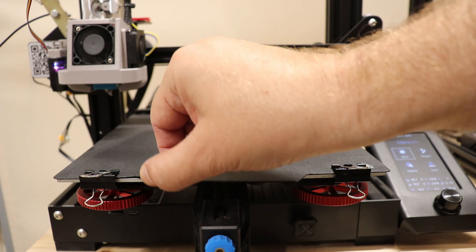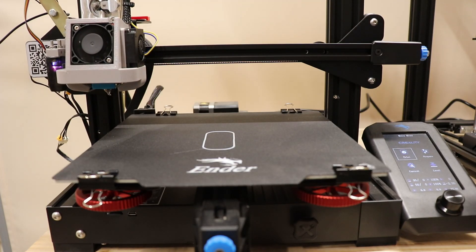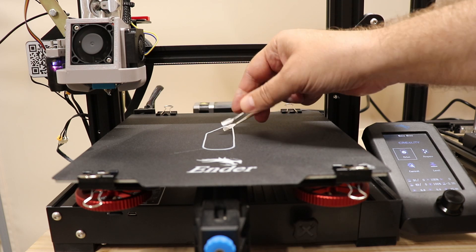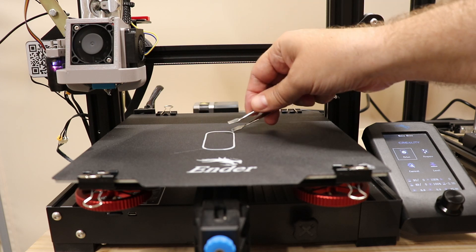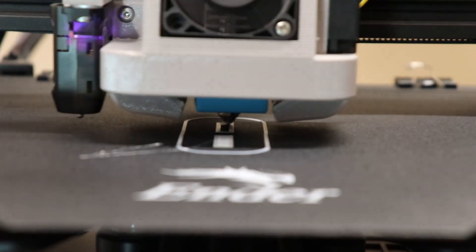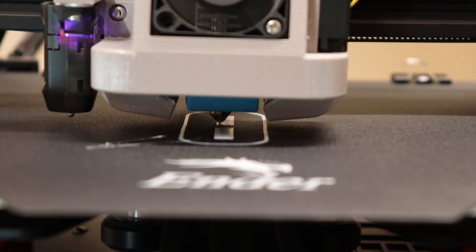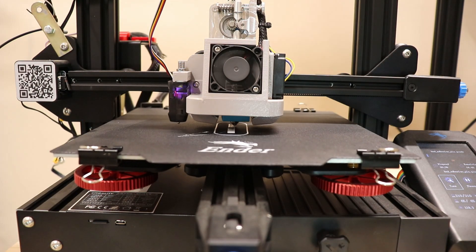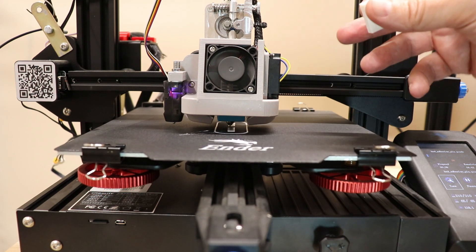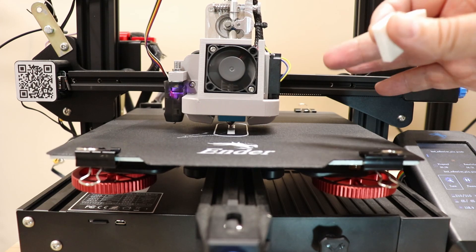This is why I really don't like this surface. Let's remove the skirt. The adhesion of the skirt is not bad, so I will give it a second attempt. I raise the bed temperature by 5 degrees Celsius, and I hope now it will finish without any problems.